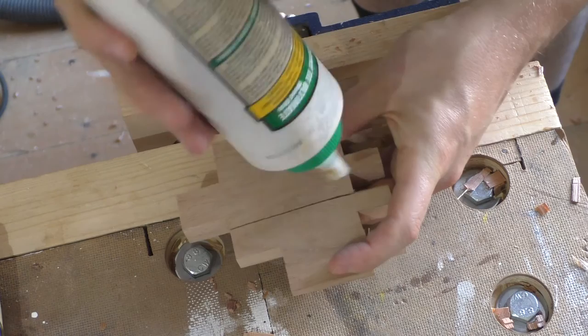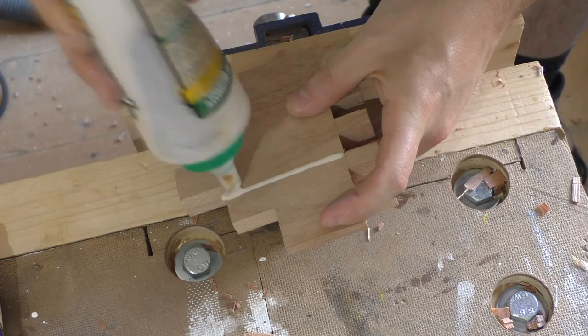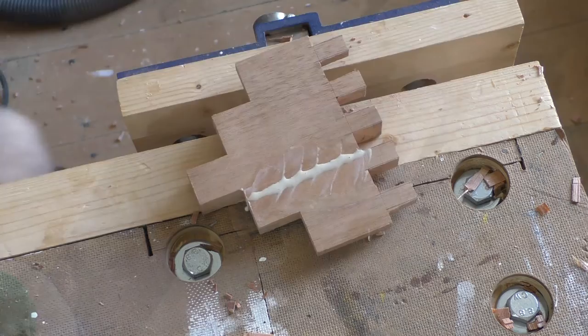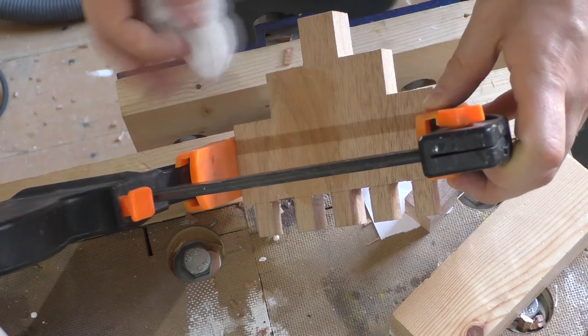The fitting process is exactly the same for the front piece but you have to be a lot more careful because parts of it are now quite thin. Unfortunately I went at it like a bull in a china shop and managed to split the piece along the edge of one of the steps. Fortunately the split didn't go all the way through and it was on the inside, so I was able to perform an invisible repair by forcing glue down into the split and then clamping it overnight. Just here though you'll spot mistake number two — rather than waiting for the squeeze out to dry I wiped it off with a bit of tissue. I was planning to sand the piece so I thought this wouldn't be an issue, but the glue that got onto the end grain was sucked deeply into the piece and affected the final finish.